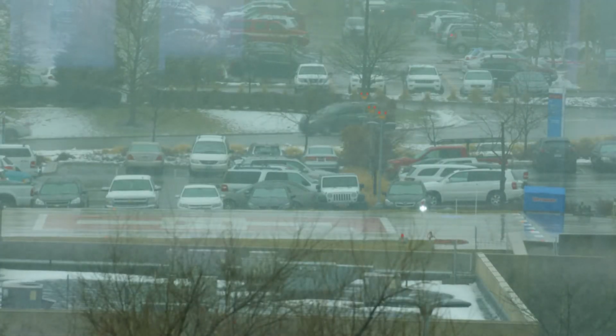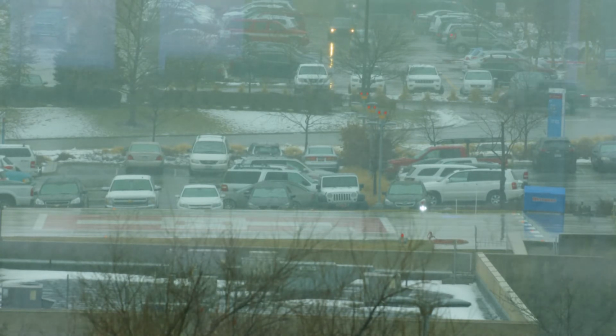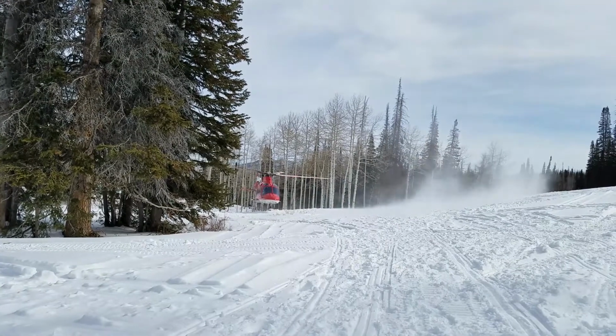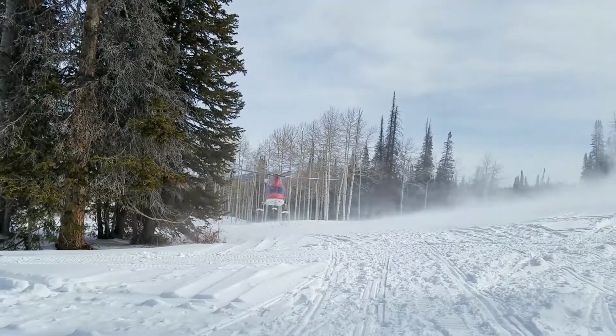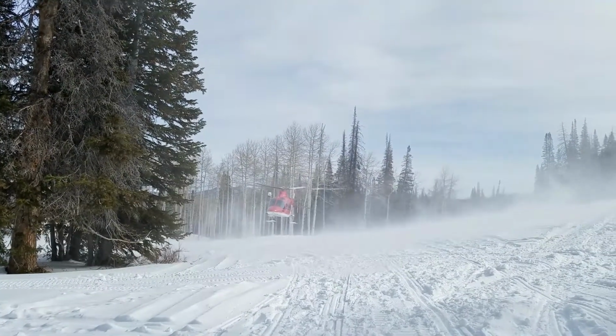Winter conditions require special consideration for ground and flight crew safety. You should make sure the helipad is free of snow and ice, as it can be a slip and fall hazard. Loose snow and ice also present a whiteout hazard and a FOD hazard for the flight crew. If your helipad isn't heated, you will need to clear and de-ice it for winter operations.